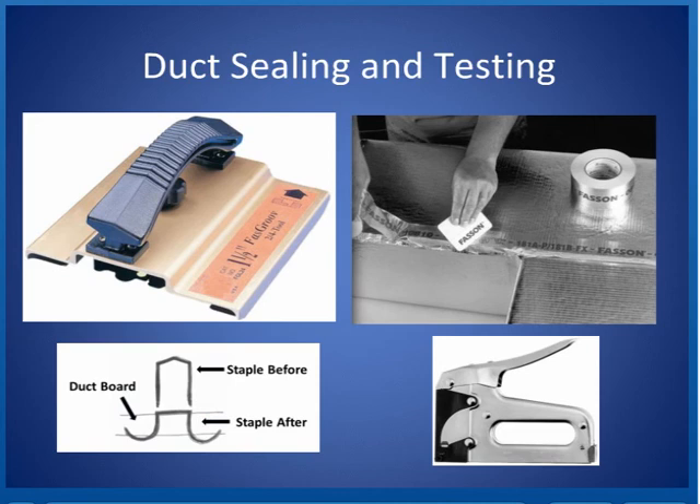The technique you use probably depends on what kind of duct you're repairing. If you're building duct board — you can see up here on the top left a tool made for cutting duct board so it folds together and seams — there are different types of cuts for different types of joints. You usually put down some tape and use something to rub it with to make sure it sticks. We would staple the tape and put another coat of tape over it, but the staple for duct board has to have a special kind of staple that curves outward, or it won't hold. If you put a regular staple in duct board, it's just going to pull right out.